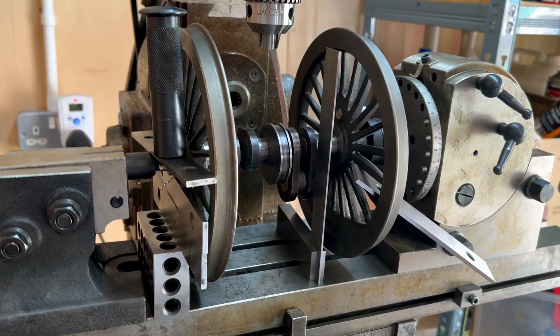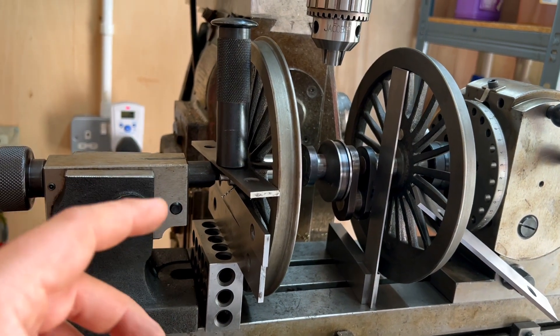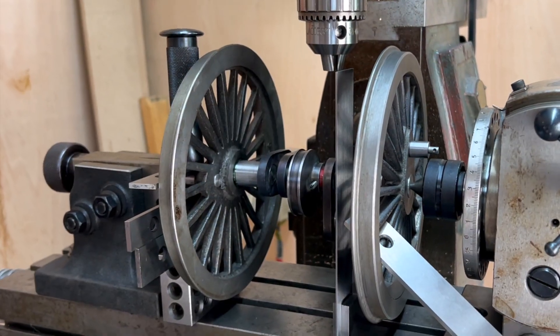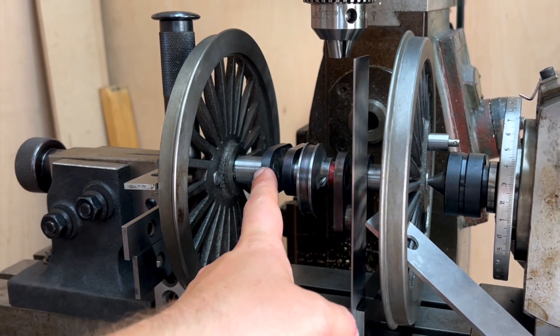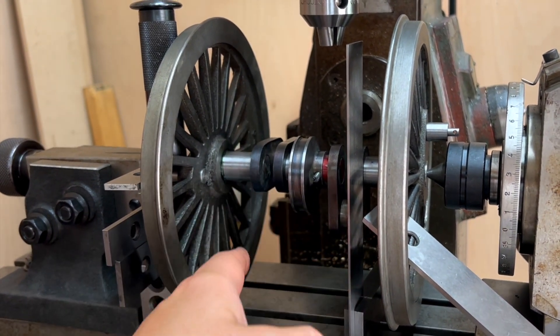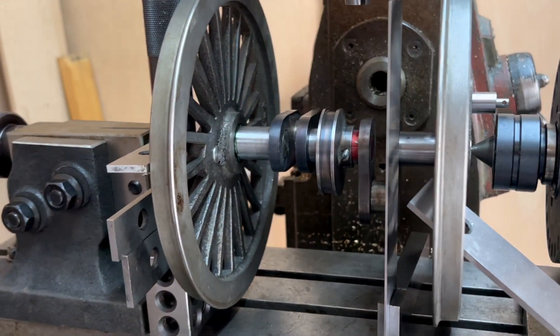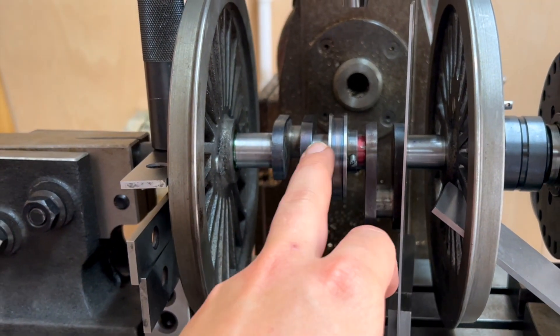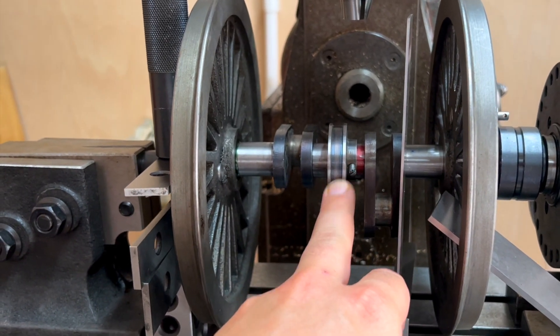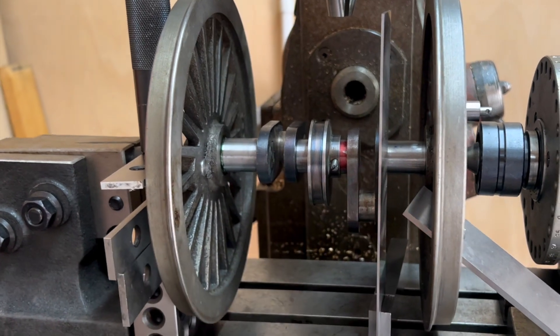Just got some various weights dangling off to keep everything rotated the correct way. I'm glad I did split axle boxes because obviously there's a tiny bit of residue coming in here, and having to clean that off with the axle box in place — pretty sure the whole thing would get gummed up completely. That's what happened when I first did the axle with the pump eccentric: a tiny bit of Loctite got inside the bore and locked it completely.